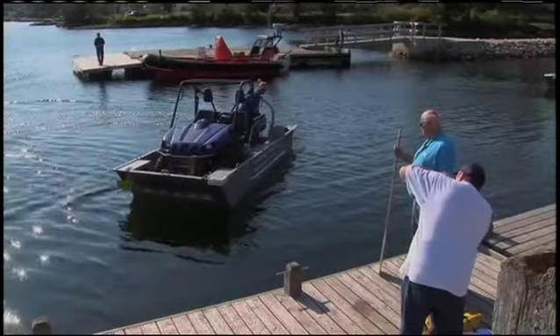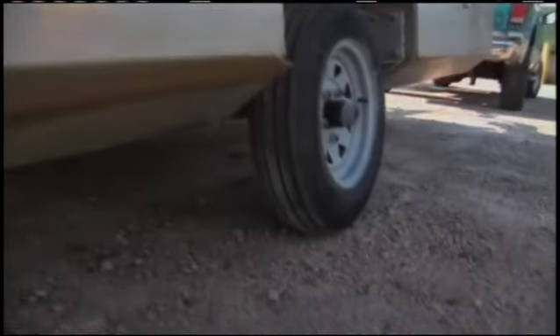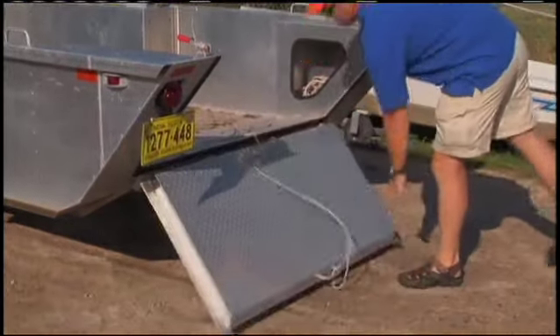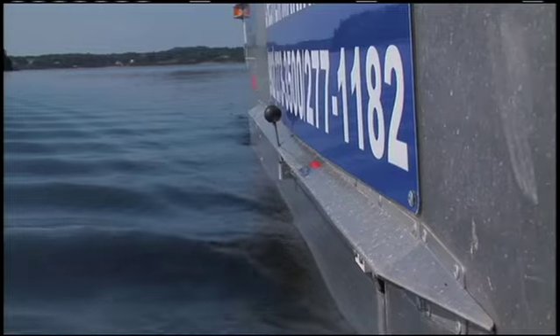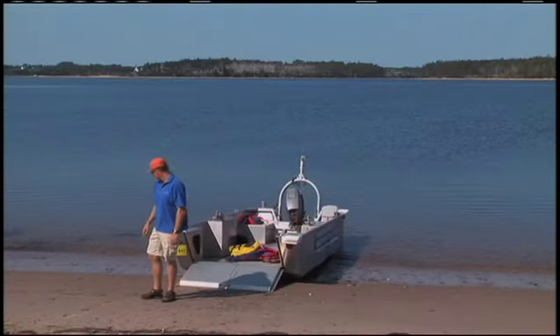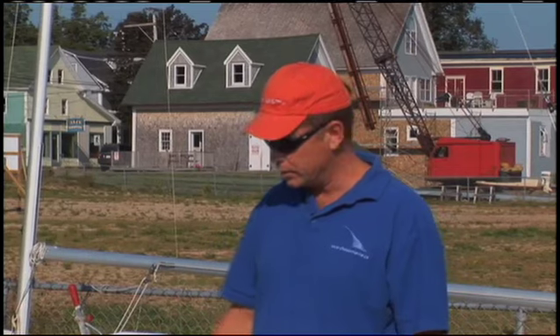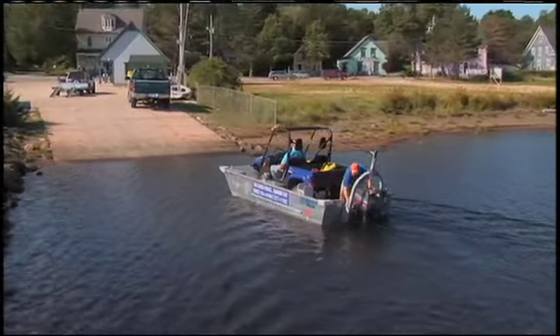The float trailer is a multi-functional boat, barge, and trailer in one. It's a flat-bottom boat with a front that opens up — you can see the flap coming all the way down. Once it's in the water the boat will sit deeper and the flap won't go as deep as it does now. When in the water we can leave the flap completely down; for example, when diving, the diver can practically step off the boat and climb back on. There's about two to three inches left, giving the same effect as a Boston Whaler — practically unsinkable with a lot of buoyancy.